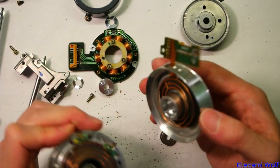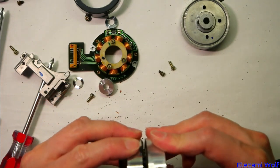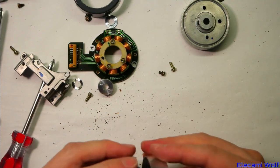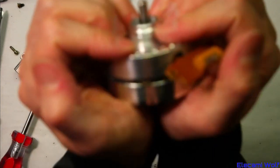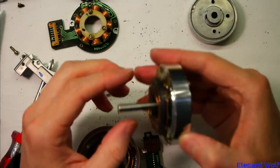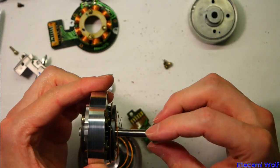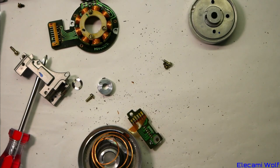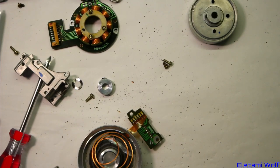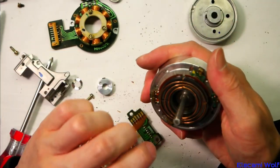I don't think we can get that out easily because it's now up there — we'd need to get the top bit to pop off, or the shaft to let go instead of the bearing. I think it's another wrecked bearing up there. That one is definitely wrecked because when I turn it I can feel it and hear it too. Bearings are wrecked. Wow — must have seen a lot of hours to get like that. That's quite amazing. I don't have an axle puller or anything to get that out.